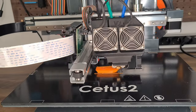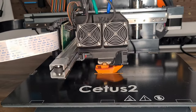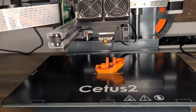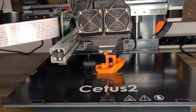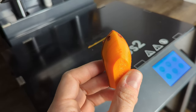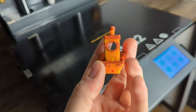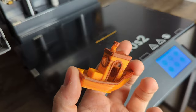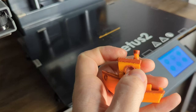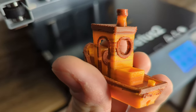After printing my second Benchy, I took some time to learn about the TierTime slicer by watching videos on YouTube. While the software is not intuitive, it helped to see how the engineers at TierTime use it. After learning a couple of new things, I was motivated to create my third Benchy. While far from perfect, this Benchy looks way better than the first one. There are almost no artifacts on the lower part, but at the layer where the brown deck started, the orange color gets a bit darker — it looks like even though the filament changing improved, there was still some dirt in the nozzle. Way worse is the upper part, where the printer had no space to purge the filament after switching, causing color bleeding on the housing and on the lower part of the chimney.